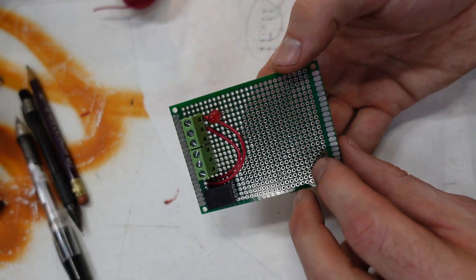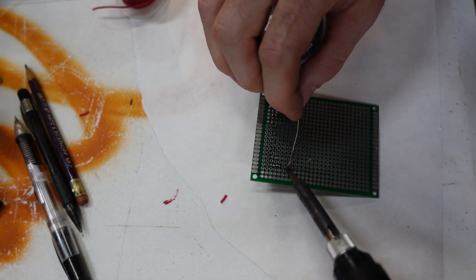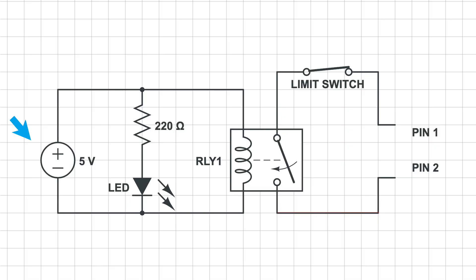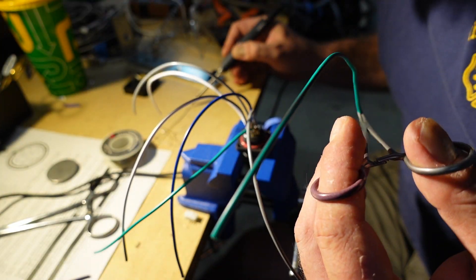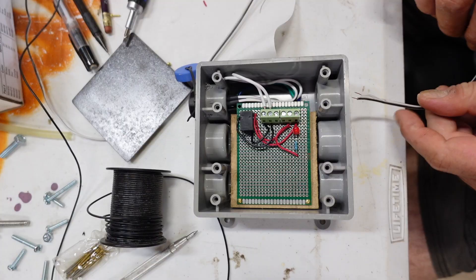Since our simulation went pretty much as expected, we're going to make up a more permanent circuit board and add in a few extra features like an LED indicator light, which might help later if we have to troubleshoot problems. On our circuit we have five volts coming in from our control board, a 220 ohm resistor and an LED as an indicator light, and then a relay which closes a circuit between pins 1 and 2. Off to the side there's also a limit switch — part of a breakaway holder for our torch, a safety feature I'll get into more later. Meanwhile Rob is soldering leads to a 12-pin connector so we have the option later to add things like a torch height controller.